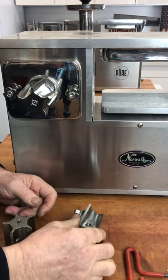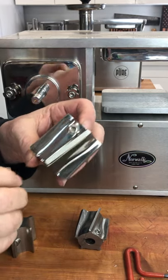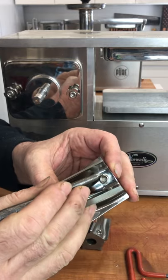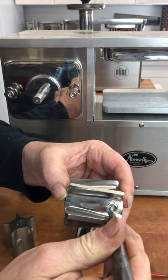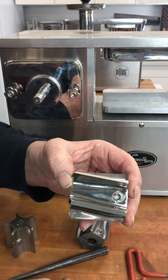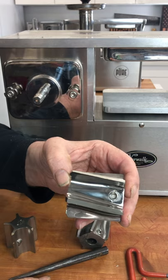There's something I want to show you about these set screws: they are not really intended to be adjusted and they are locked in place. If you look very closely, there is a small dot called staking. What was done is a center punch was hammered into the metal, deforming it and squeezing the threads — locking the set screw in place at a factory setting.